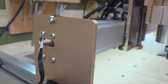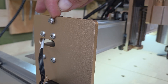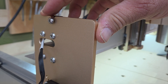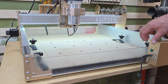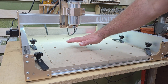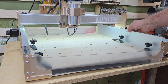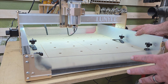I've never put a CNC machine together before — I've done a bunch of 3D printers. On this little bracket, there's a screw sticking out that held it at the exact right height to get the screws started, and that was the only reason that bracket was there: just to make assembly easier. Those little things really stand out to me and show they've thought about a lot of stuff. If you're going to put a big piece of wood in here, you can just flip this control panel out and now it's wide open. The back panel comes off and you can lay a big wide board in here and engrave out in the middle of it. Also, like a lot of big-name brands, it has metal shields that come up to protect your wheels and rollers from sawdust getting into them and causing problems.